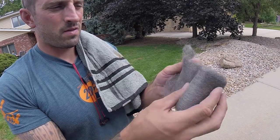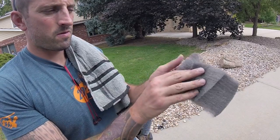I would definitely suggest using quad zero steel wool just for touching up little bug spots or something that might still be in the window after you've cleaned it — it will clean that right off. And if you don't have any bronze wool pads, take your quad zero steel wool, unfold it, and fold it into a piece about as big as your hand. That helps a lot. But overall, I like the bronze wool pad best — it has eliminated so many steps.